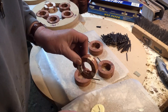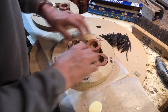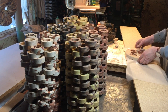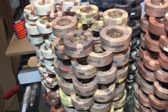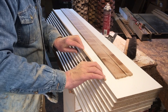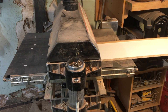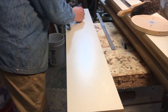Eventually my 500 rings will give me 100 assemblies of five. This project has many, many steps and there are many, many more to go. Now that I've got my 100 assemblies of five, I need to start treating these as if they were one ring. I'm going to taper my rings using the trays of melamine with a shim under one edge — the shim will be dimensioned by running it through the drum sander to get the right thickness to create the needed taper on my rings.